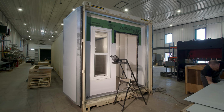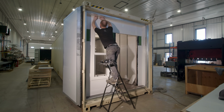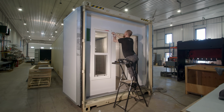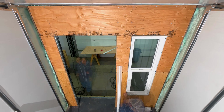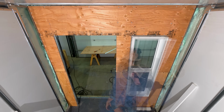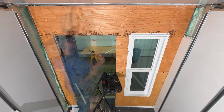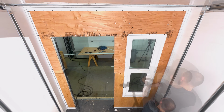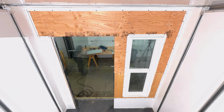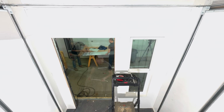So really make sure that you line up your grout lines, so to speak, and ensure that you start with an intelligent height of a panel so that everything works out and you can snap everything in. It's always fun trimming around windows and doors, whether you do this out of tin or these types of panels, and it just takes a little bit of common sense and problem solving no matter which way you go. But I'm really liking the way that this is trimming up and finishing up, and seeing it in real life when it was all said and done, I can say that that is our best work so far as the carpentry goes. Good job, Brady.